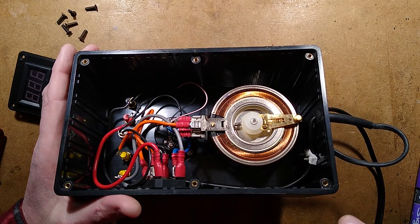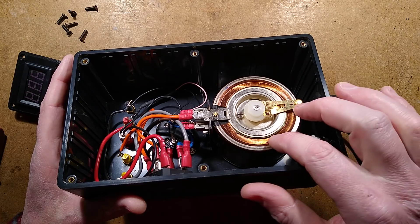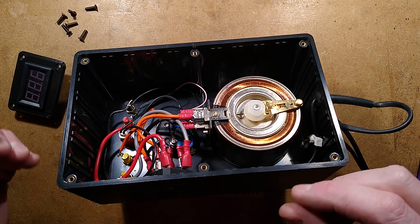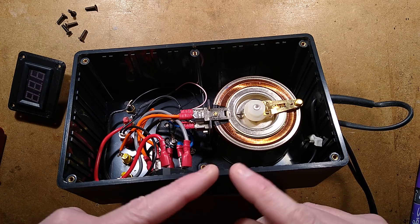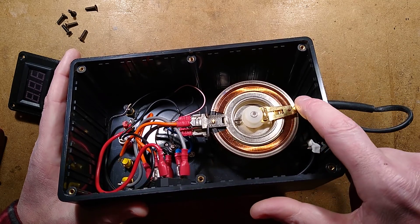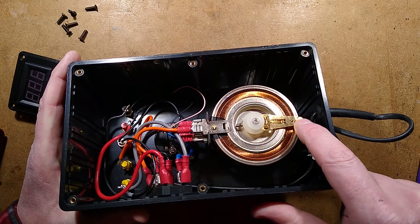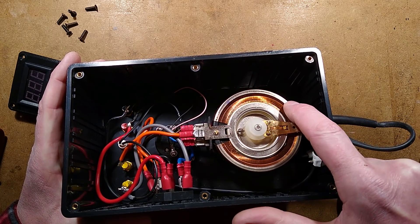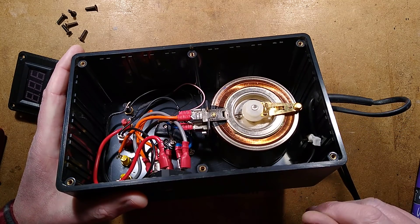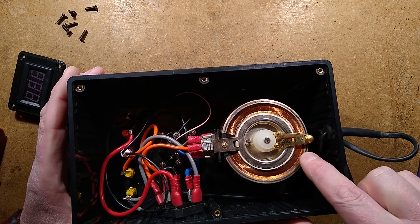Something that's always puzzled me about these: generally speaking it's considered bad if you short the windings on a transformer or a motor — it's quite often the main cause of failure. A motor burns out when the windings short together and lots of current passes through that winding and it goes up in smoke. In this case, you have this brush that goes round, and I thought maybe it just doesn't touch two windings at once — but it does. I've looked and I've seen various theories for how this works without shorting out the windings.